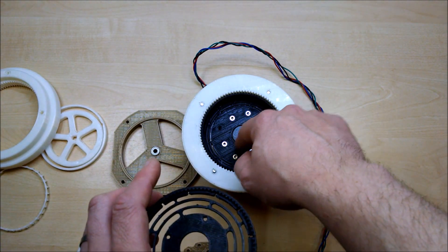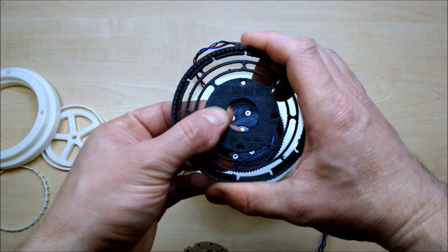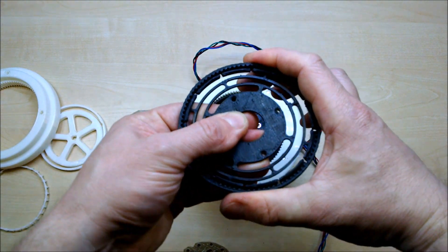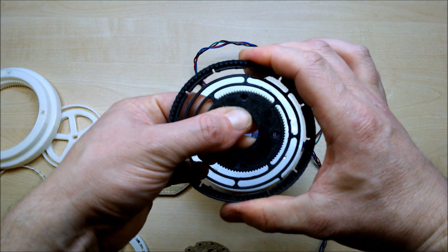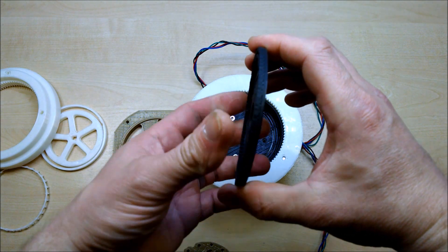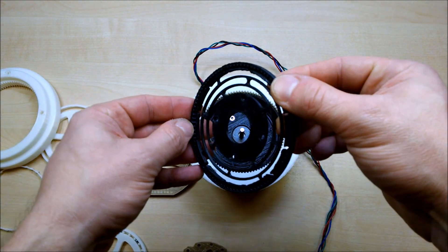One of the things I put in this design on the back plate that's bolted to the NEMA 17 motor - this is an early version of that - was a way of getting rotational stiffness, but at the same time allowing that elliptical deformation to be in the belt all the way, even right up to where the disc of the splined cup was.